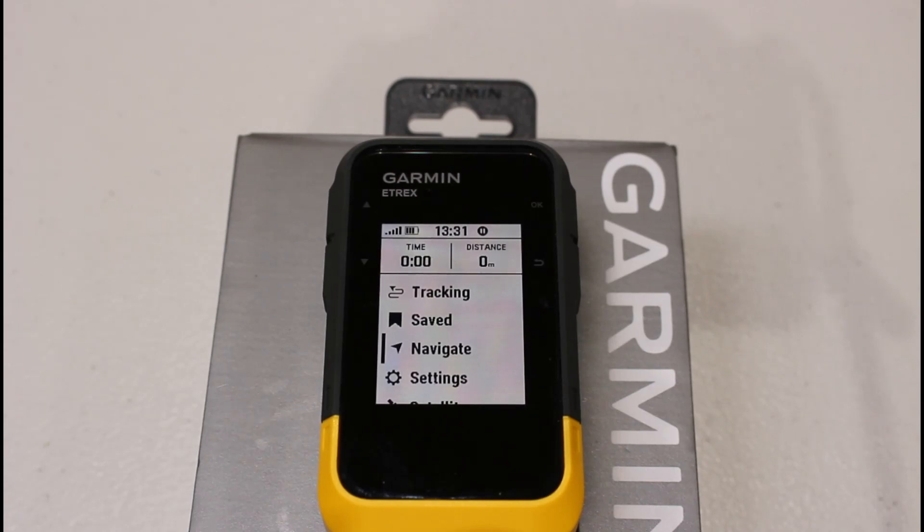You should also recalibrate if you've changed your batteries or had a sudden change in temperature, or if you feel that when walking it's not lining up with a route you've marked. It's not a bad thing to recalibrate the electronic compass. We have found that if you put the device near something magnetic — like a magnetic wristband or an Apple Watch — it can put the compass calibration out and you'll need to recalibrate. Just something to bear in mind.